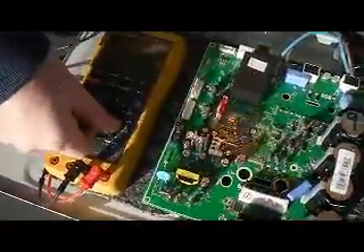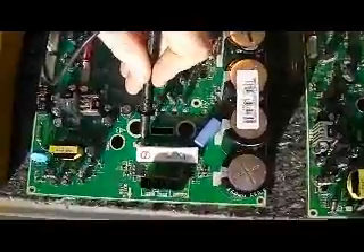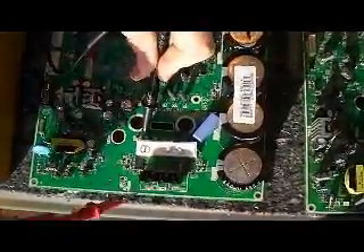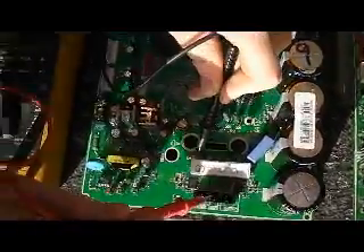You'll need a multimeter to do this turned to your ohms range and the test is very simple. All you need to do is take your black lead to the minus which is any of these three plugs and connect it to each of the compressor terminals. You should see a value of about two mega ohms on each measurement.